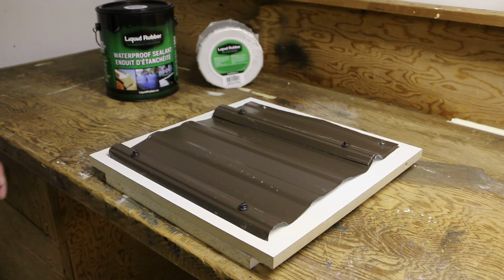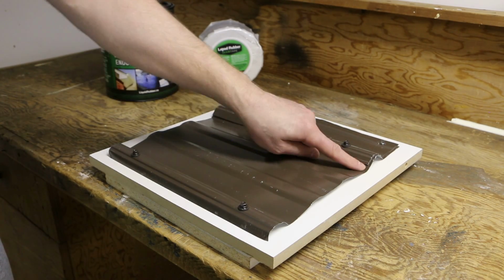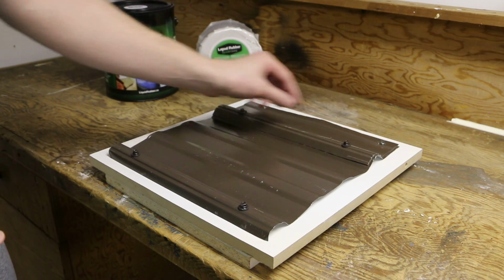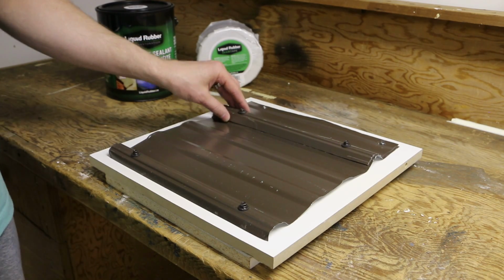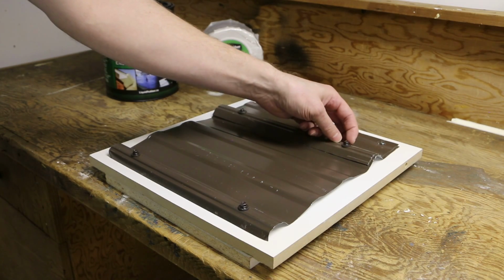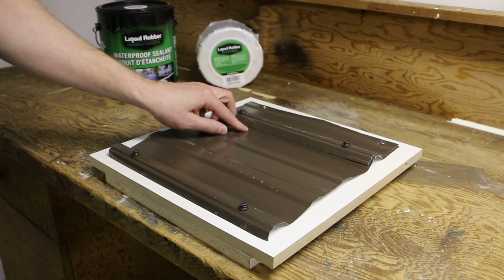Okay, I'm going to show you kind of a typical metal roof application here. The issues: there's a seam here and you get your fasteners here. That's where you're going to get your leaks from most of the time, vents and whatnot. What happens, there's little washers on these fasteners. They break down and get loose, water gets in there, water will get in your seams.